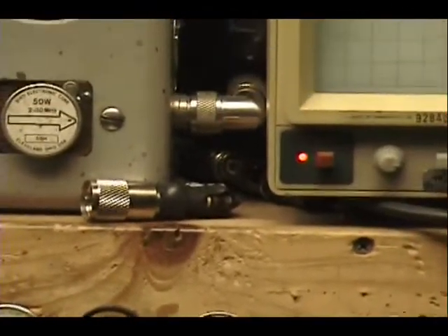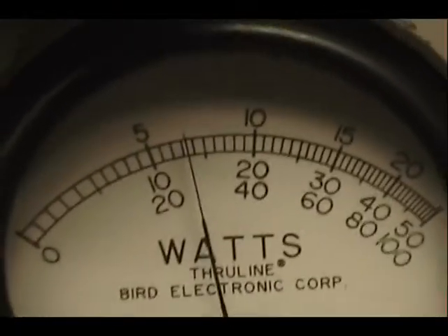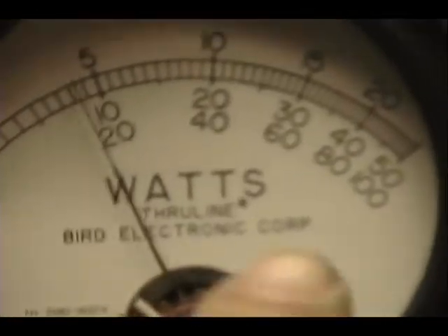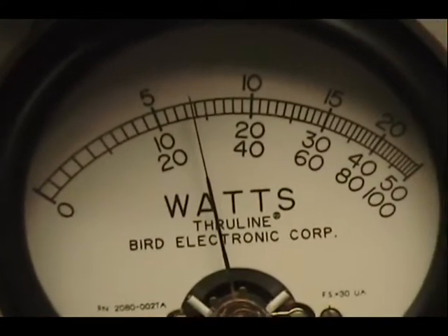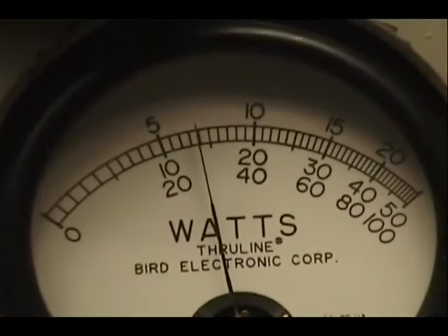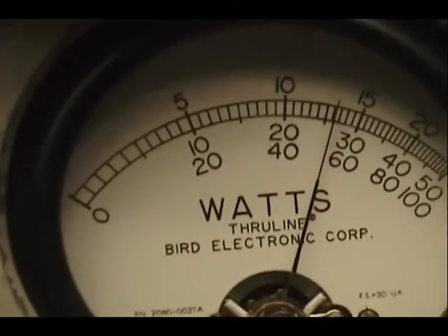This time I usually don't show it, I probably should. Here's minimum power on sideband — audio, if you had something smaller you needed to drive. That's 10 right there, 15's that little line. So with the sideband power all the way down, looks like we're right about 13 to 14 watts of SSB with the power at minimum. And as I bring the power all the way up — audio check, check, check — more like 26.